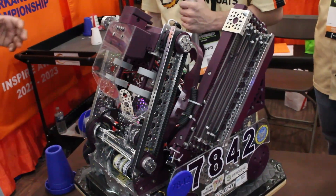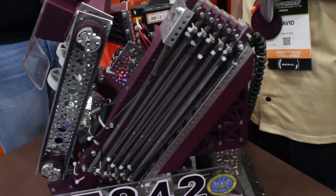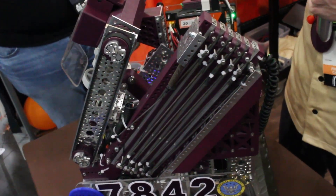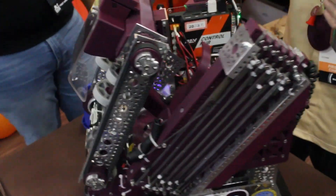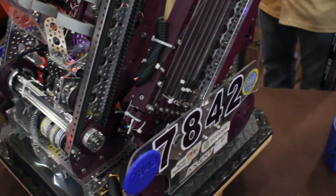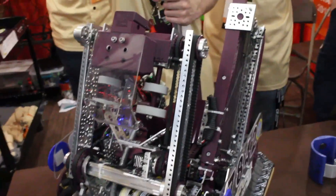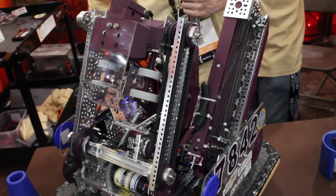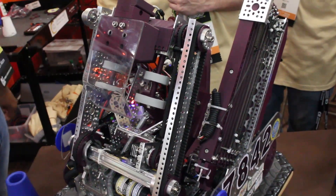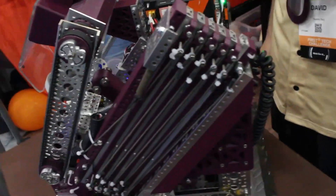You've seen a lot of other teams this season run dual slides — one stack on either side. You guys decided not to. Walk us through why. During the beginning of the season, we went through brainstorming of several different slide designs. We were thinking of doing just a vertical elevator. But we found angled slides are great because we can move a cone not only forward but out as well, so we can lift it up and get to the junctions as quickly as possible instead of having to go vertical and drive to that pole each time. We just found it to be the quickest design. And it's lightweight as well, because each stage — Misumi slides are very light, and the 3D-printed stages in between are very lightweight too.